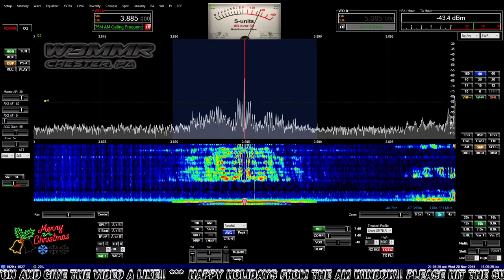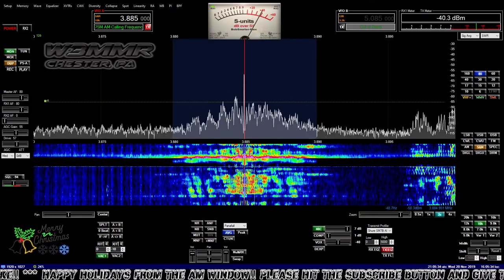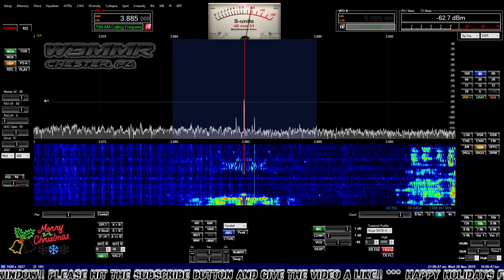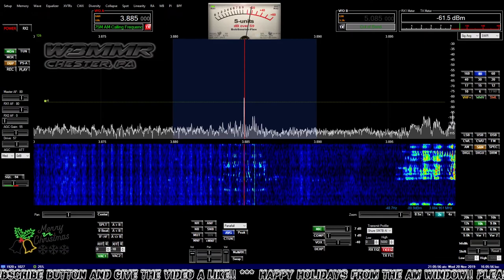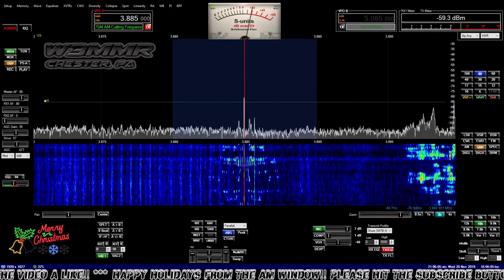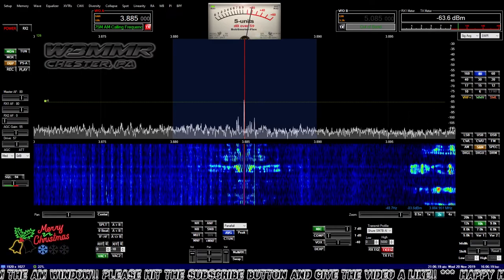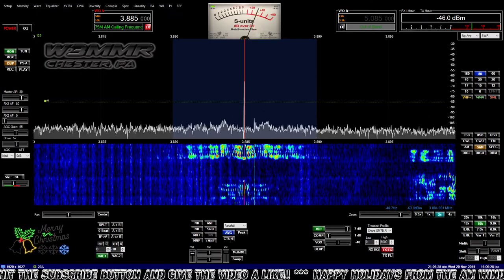Yeah, hit the record button and give it a shot. After doing a lot of reading about common-mode chokes — let me switch the array here, hang on. I never want to hot switch it. A 61 material was a good compromise as far as permeability and being able to handle power. RG-303 is excellent — 303 is similar to 142 double-shield. The common-mode chokes were a good idea versus wrapped-up coax. Let me flip it back one more time — heading southwest.